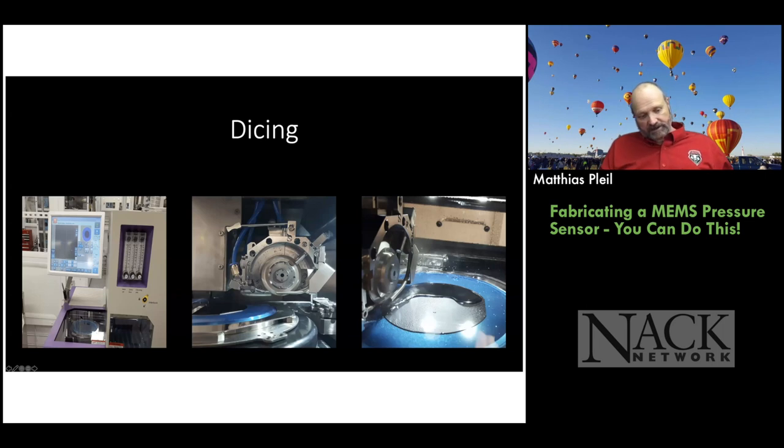But here you see it on the stage on the left. So we load it up on the left. It'll take it underneath to the right where the dicing saw is. And this is an actual mechanical saw. So it has a blade, right? And the blade is maybe 40 microns wide. So it's not like what you use at home when you're doing wood. It's a diamond encrusted epoxy kind of thing. And it spins at 30,000 RPM. And it'll take your finger off. So that's why everything's enclosed in plastic, and you can't get your fingers in there. And it has lots of water. You see this process and there's water flowing everywhere because it keeps things cool.